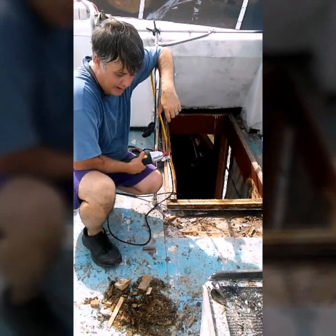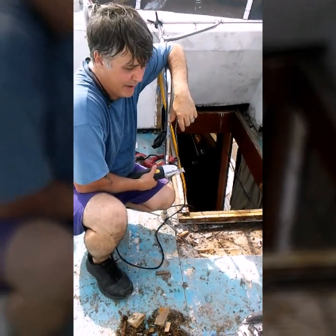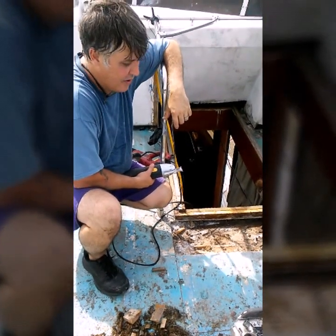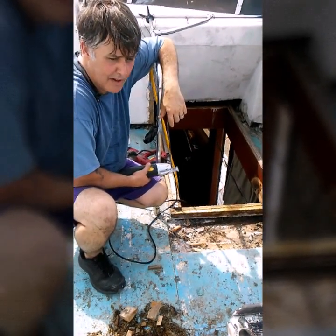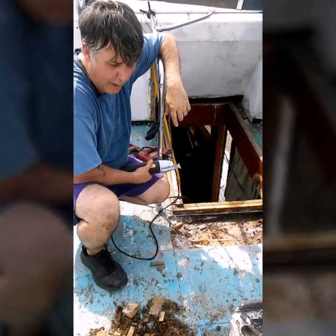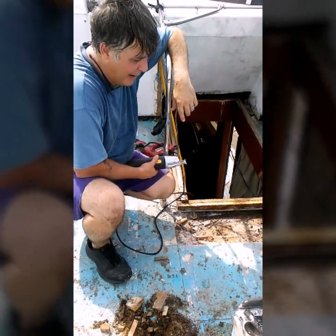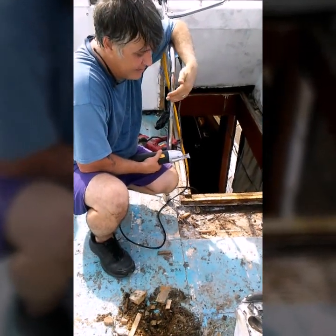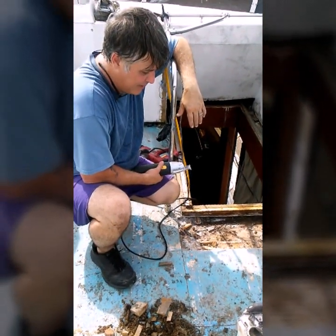It can sometimes be a small spot like this one or it can be a huge spot. We looked at multiple boats when we bought this one — we knew it had some wet deck spots here and there. I'm still not sure of the full extent on the entire boat. I know around the other hatch on the back of the sun deck I have another small area, probably smaller than this. But if you let it go it causes real problems. It's better to fix it — go in, cut it out, dry it out, clean it up, and put new core material in.